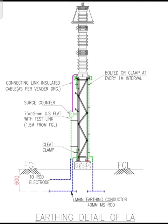If you go through all these three important documents, or even refer to the CBIP Manual 339, it is clearly mentioned that the lightning arrestor should be connected to ground with one dedicated ground electrode, and there should be no bends so that the impedance of the lead connected to the rod does not add any more resistance in the path of discharge of lightning current.